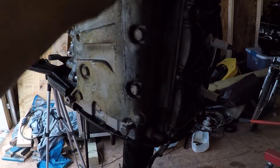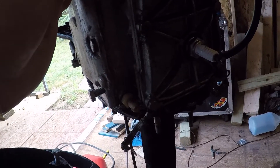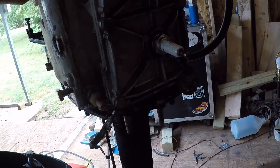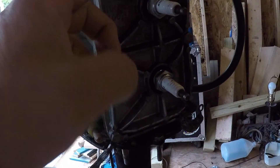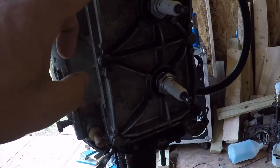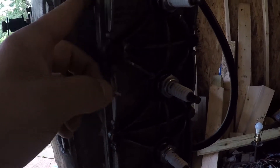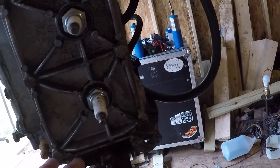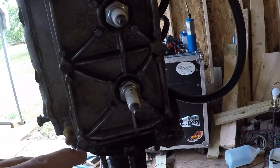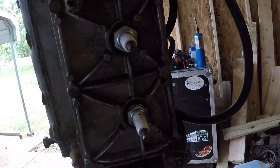There are a couple things on the bench — get this off, obviously, and then I'm going to remove this head too, which means I'll have to get a gasket. I just want to check it and make sure it's in good shape, and then either I'll replace this one with one I've got in the shed, or I'll get this out and plug it because it doesn't need to be open like that. I'm going to have to heat these bolts up most likely to get them out, so I'll just do a butane torch — light heat, because I don't want this to warp. I'll heat them all up individually and then break them all and get that off of there.